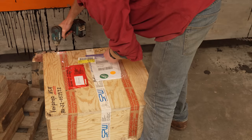We did a lot of calculations about the best diameter, the best size, the best amount of blades, consulted a lot of different professionals, and this was the propeller we came up with. It's slightly smaller than is ideal, but it's a compromise because we didn't want to have to cut a huge hole in the rudder. This propeller will work with the regeneration capabilities of the electric motors when you're under sail. Basically, you just have to lock the propeller into its reverse position before you actually start sailing and regenerating.